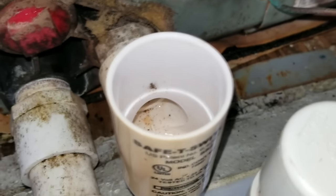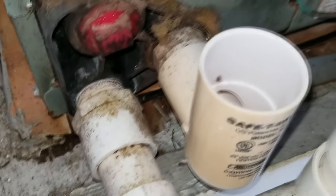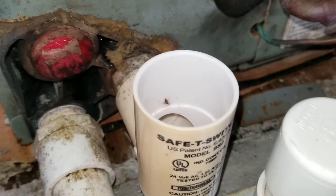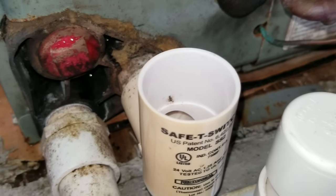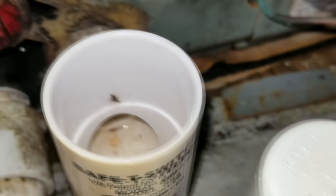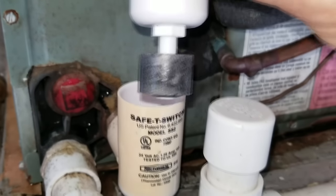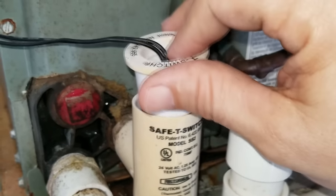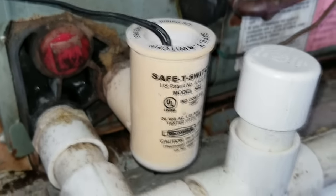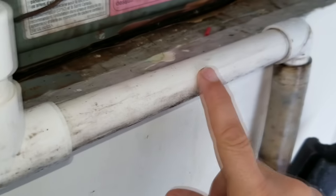But typically that's what happens. That's how you know somebody didn't clean their AC filters — the filter will clog and cause ice to form on the coils inside your air conditioner. That causes an excessive amount of water to show up in the pan, which fills up this cavity, makes the float rise, and your AC cuts off. You're wondering why your AC isn't coming on — but that's not the case here. It looks like we just had a minor clog.